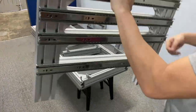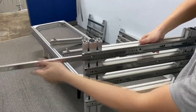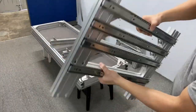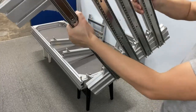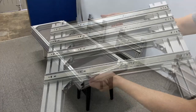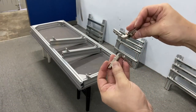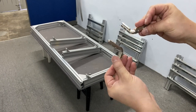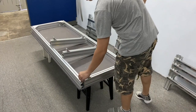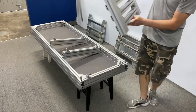The aluminum extrusion rods that hold up the drawer slides are the most challenging part of the build. I had to take most of the frame apart and made sure of precision alignment before putting everything back together. And while I put things back together correctly, I now start building it back upside down, starting from the tabletop up, to ensure that the tabletop is completely flat, eliminating any unintentional flex or bow. The design of the frame is very specific to how the drawers will eventually come together.